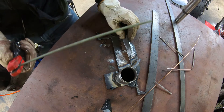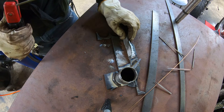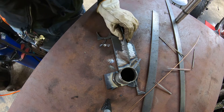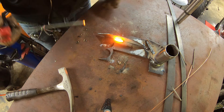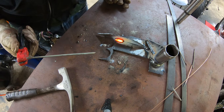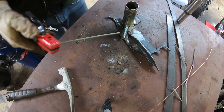This is an E308L-16 stainless steel stick rod. I'm going to turn it down to 60 amps, tack it on with this, and then run a short bead because the craters always come out. And yes, this isn't stainless but it welds pretty much the same on stainless or mild steel — just for demonstration purposes. Run a little bit back this way.